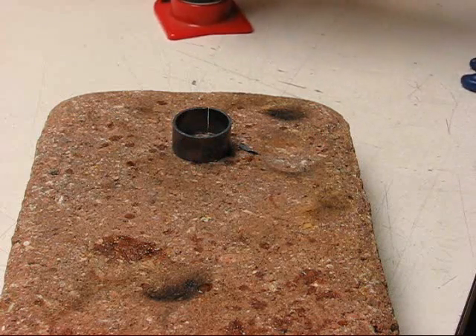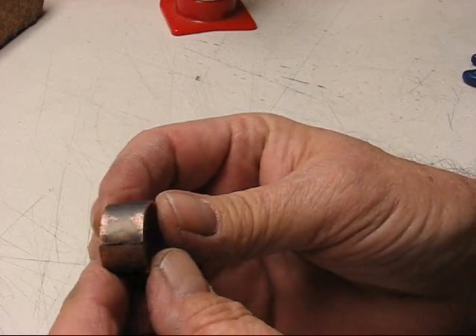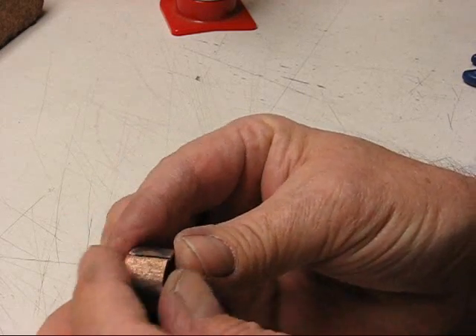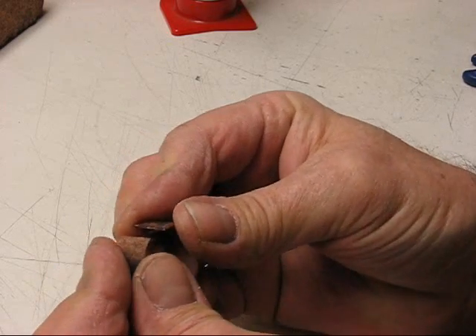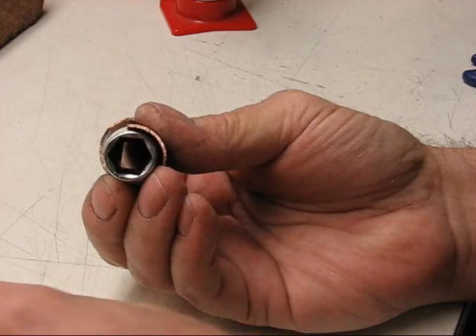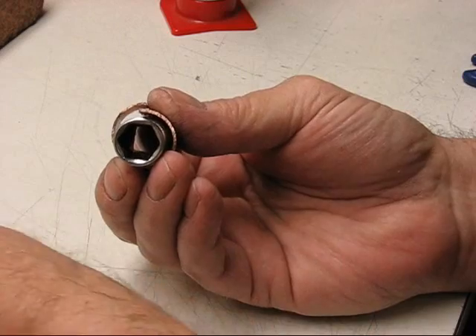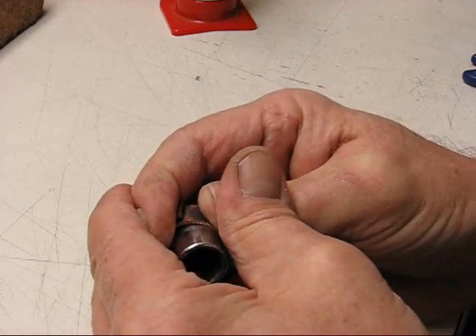The reason for it is that by annealing that copper it gets really soft and I can deal with it. I'll come back after it cools and show you what I do with it. I've cooled the copper off — I actually put it under water, which took a lot of the black off. Now you see how easy that copper is able to be bent. What I do is take a socket that's the same diameter as the ID of that Maglite head and form the copper around it. It's nice and soft so I can form it around.